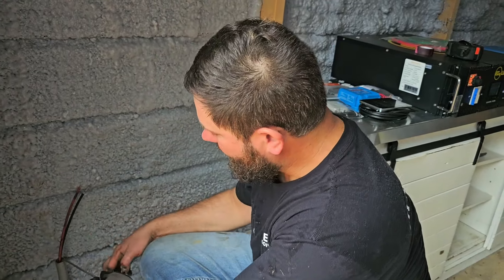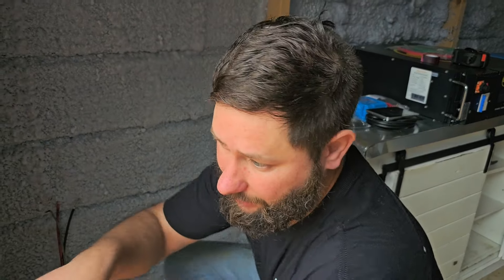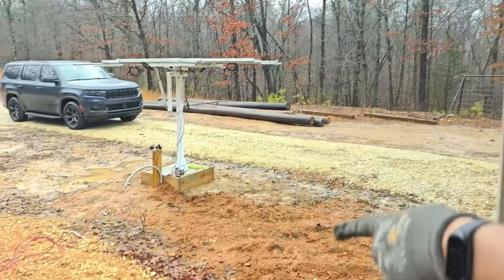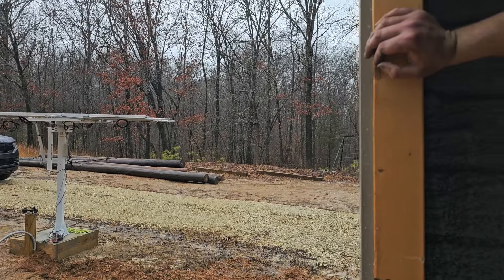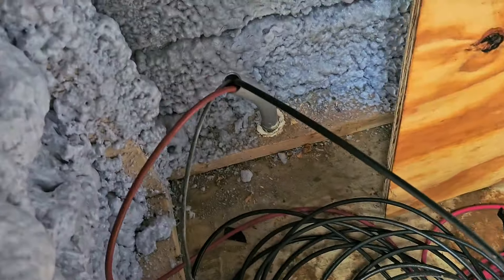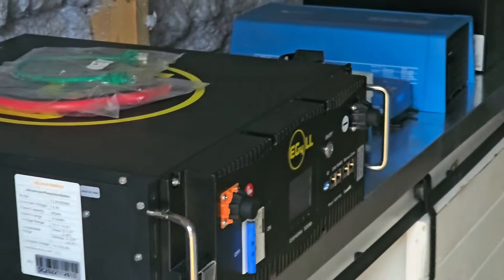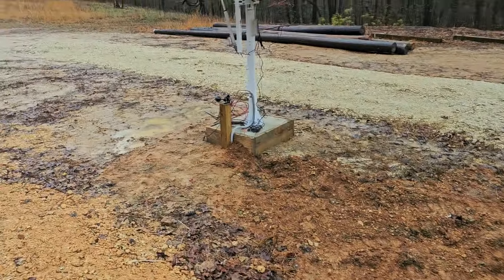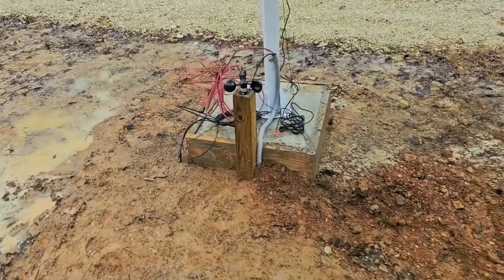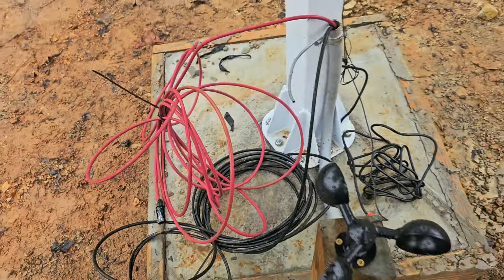I need to pull my PV wire on through. I've got 100 foot of PV wire but only 50 foot of this communication cable, so I'll pull the rest through and probably put a little junction box to tie on to the controller. Now I've got my wire rolled up and ready. I'm going to be able to hook up my battery, inverter, distributor, and charge controller so I can have lights, cameras, and everything I need out here. Conduit's attached to the pole and the wire's rolled up and ready.